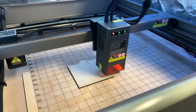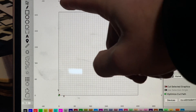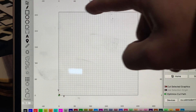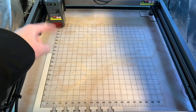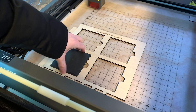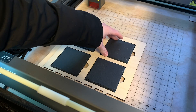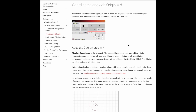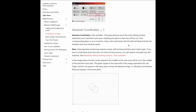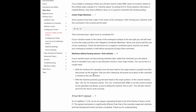It'll also help you save time by eliminating the need to guess the framing of your objects. The simplest way to understand absolute coordinates is that the work area in Lightburn represents the physical space of your laser's working area. One of the biggest advantages to using the absolute coordinates feature is to create accurate, repeatable engravings on physical items using jigs and templates. According to the Lightburn docs, the prerequisite to using absolute coordinates is having a laser with homing or limit switches and a fixed origin.